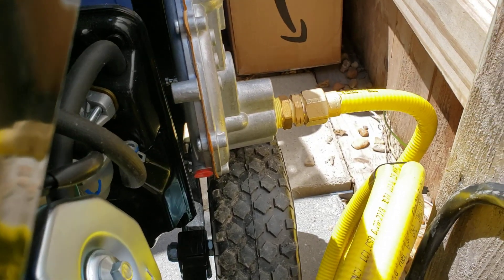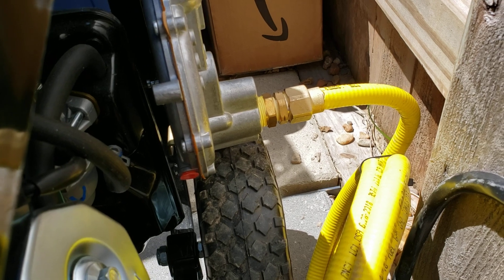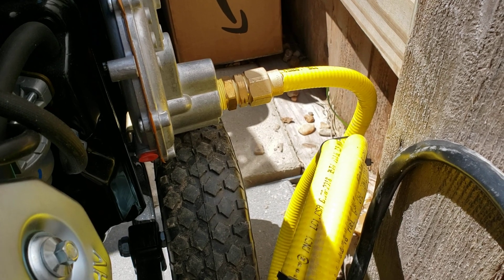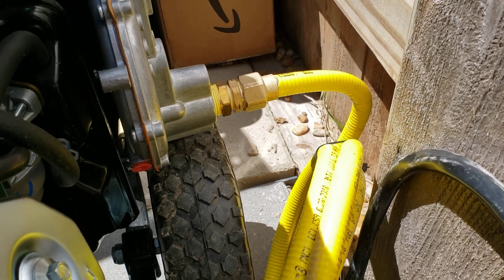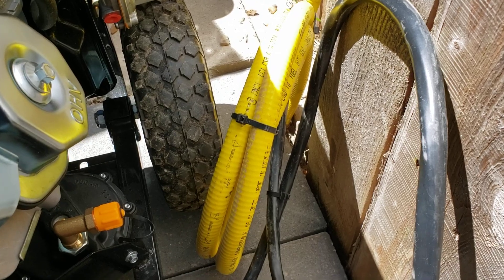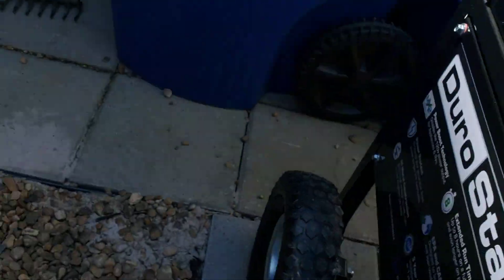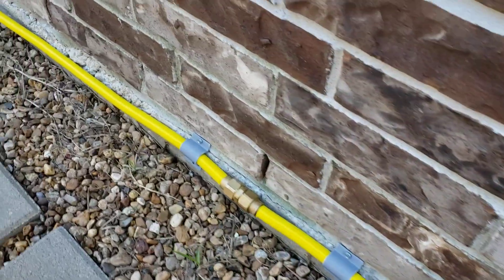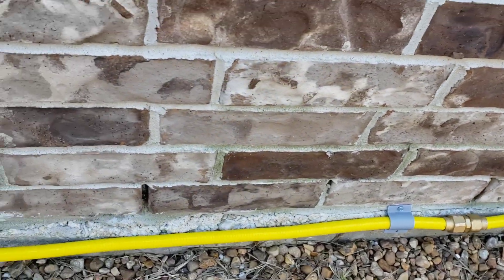You can see this is not a regular propane line — that is a natural gas line. I ran the CSST on half inch because that's what my outlet was, and I kept it the same all the way through. Along with that, the 8-gauge 3-wire for 240-volt wire is buried underneath here, tacked up around the house. I need about a 50-foot run — these are 25 and 75-foot runs — with a good coupler, all the way up through here to get my natural gas stub out.